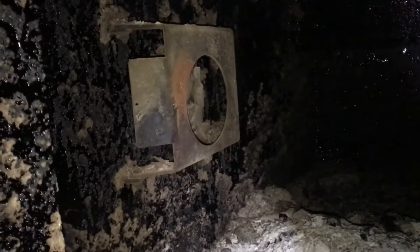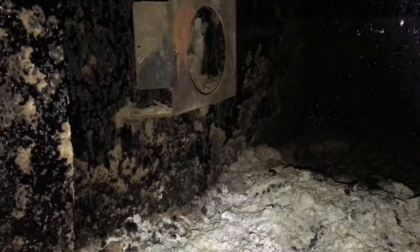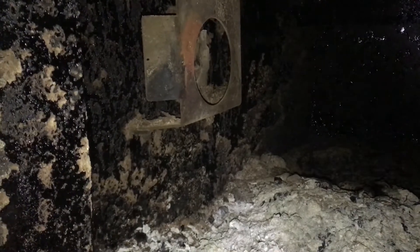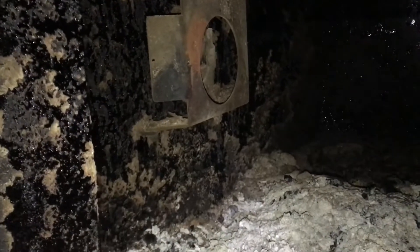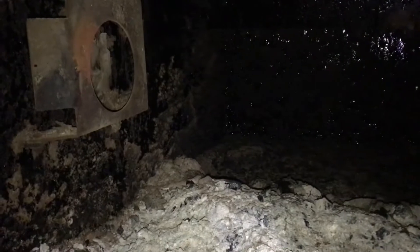The only reason it was puffing and smoking last night is I had my propane burner on, and I will put it on again here to start the fire. Because the fan blows — it is a fan and a blower that blows the propane burner flame — it is basically pressurizing the inside. So smoke is going, 90% of it, up the chimney, but it is pressurizing it, so if there is any leakage on the rope seal, you can see the coloring — it is all nice and white there, then you can see right there it starts getting black, right in that area where it was leaking.